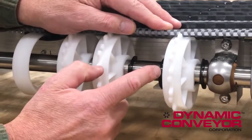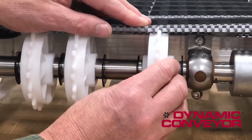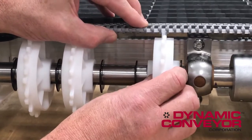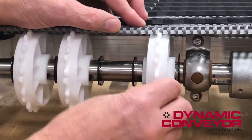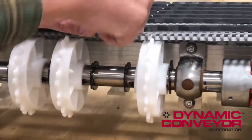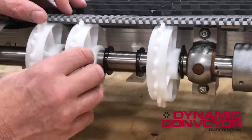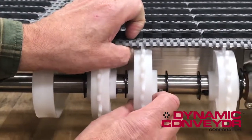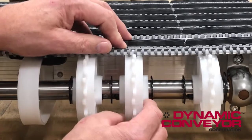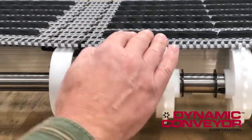I'm a little off to the side here, but I'm not hitting the E-clip. I'm going to move back one. I'm about in the same position because it has to pick this slot or that slot, but I'd still say I'm okay on that. This one is too close, so I'm going to lift up the belt a little bit and move it back. I'm not hitting either E-clip — this one's in good.